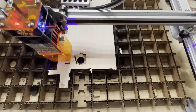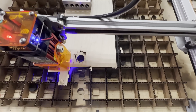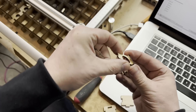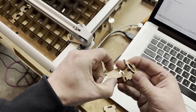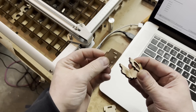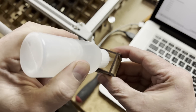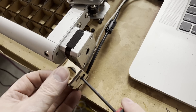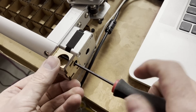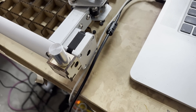This is made out of three-millimeter plywood. It takes a little longer to cut, but the cuts are super clean and everything fits together so nicely — these are things that are kind of blowing me away about this machine. The actual cut line has a gap, but that gap is so small because of the diode laser. I'm going to leave some links below for the DXF files that you can put into Lightburn or whatever software you're using.